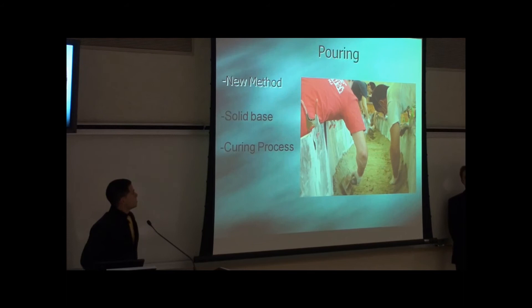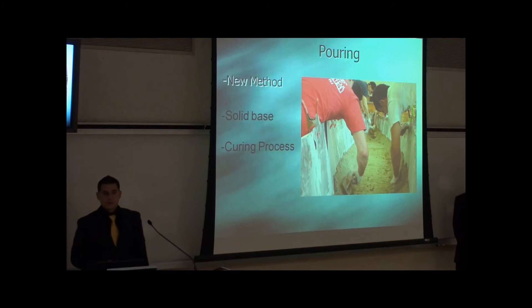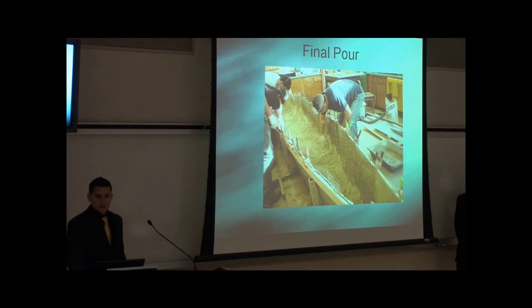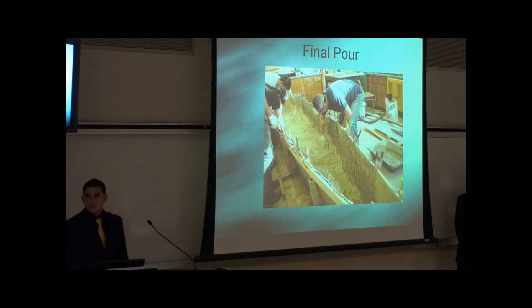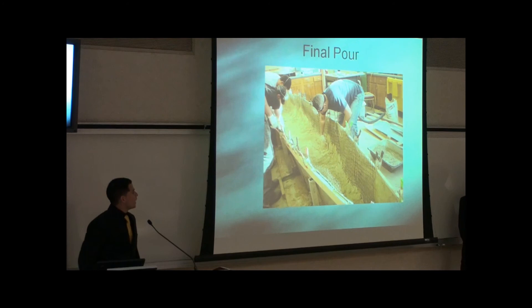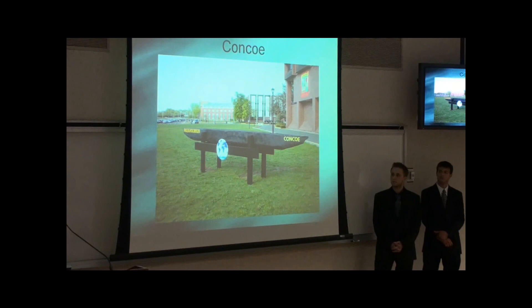Considering we were using GeoGrid this year, we decided to pour a thin layer of concrete along the bottom of the canoe. As you can see in this picture, once we had that layer poured, it was easy to work on the walls of the canoe. After having poured a thin layer of concrete along the entire mold, we then placed the GeoGrid over this layer. After precisely cutting our GeoGrid, we then did our final pour onto this mold. Essentially, these two layers became one with the GeoGrid. We allowed our canoe to sit for three and a half weeks for the curing process. During this time, we made sure we had a person with daily access to the canoe in order to keep it cured and hydrated. After the three and a half weeks were completed, we removed Kanku from the mold, and we realized our pour was a success. This is our final product.